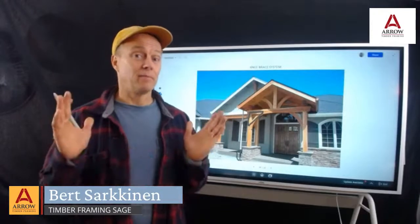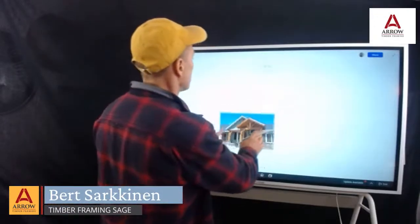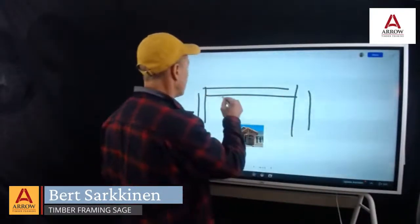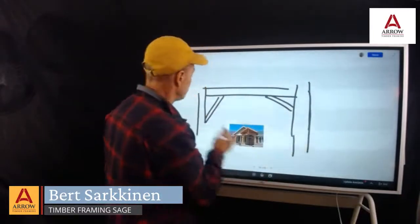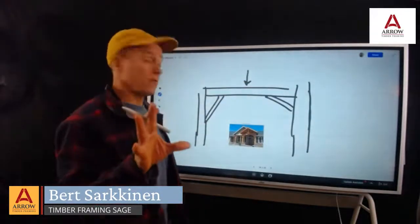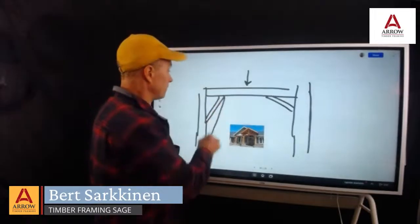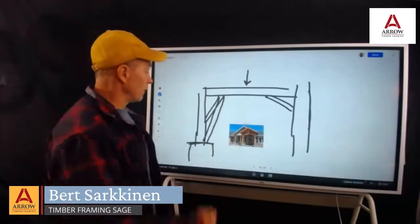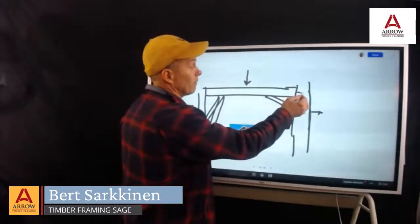It does, in my opinion, reduce the span. It puts more thrust on posts. Okay, so here, let me. So if you've got a tie beam or whatnot here, I'm just going to draw two different angles for your knee brace. We've got a load here. We have had engineers that have given us value for putting in knee braces. The knee braces typically will come at a real steep angle and sometimes even tie at concrete so that we're not dealing with thrust in the middle of the post like this right here. So thrust in the middle of the post, then we're also talking about blowing apart here.